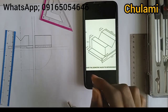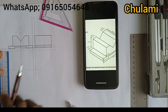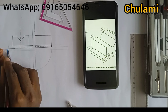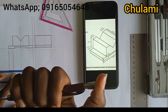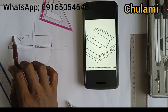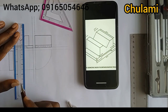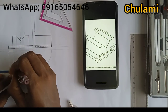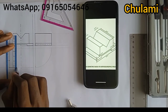Now let's draw the top view. We have this part here as the top view. That part has a length of 40mm and breadth of 10mm. So we go 40mm — instead of measuring from scratch, I already have my elongations and I'm able to match up perfectly. Following the front view, I just go 40 and 10. Next is the other side — 10 and 40. I forgot to elongate that side, so I'll do that now, exactly for the left-hand side too. So I'm going 10 to 40, measuring and making the parts thick enough because I've already elongated.